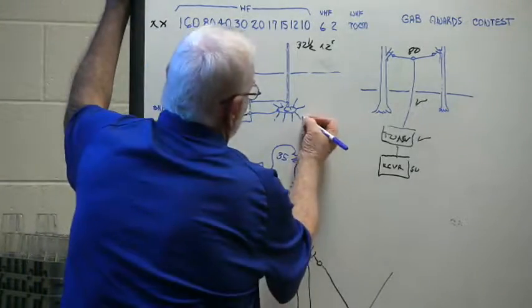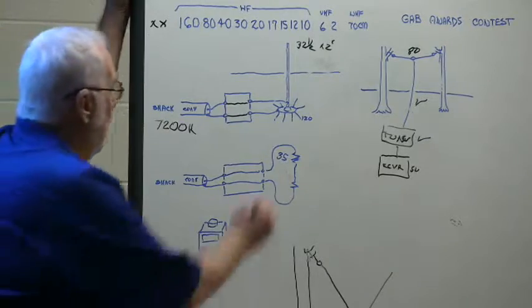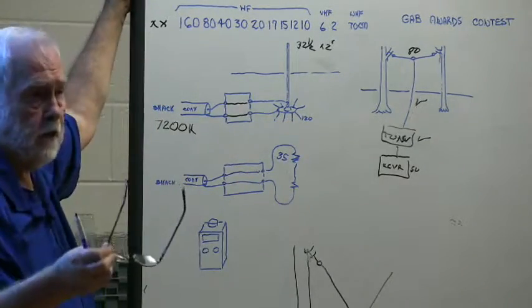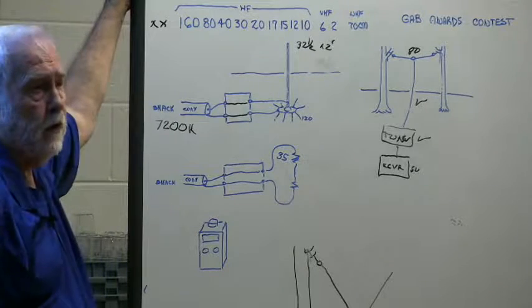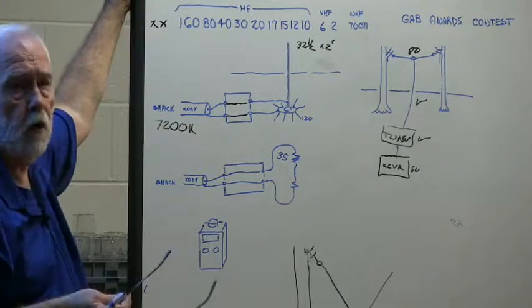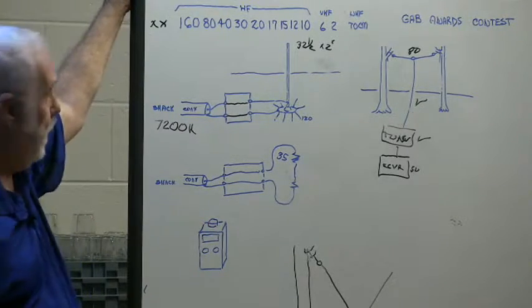they will have 120 radials, and they'll go out one quarter of a wavelength. If you put in a radial system like a broadcast station uses, you'd want to put in 120 of them, and you want to take it out about 33 feet. Now, you don't get any advantage in going over 4/10 of a wavelength. 4/10 of a wavelength is the max that will do you any good.